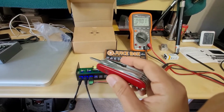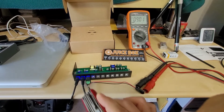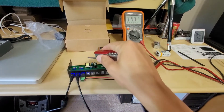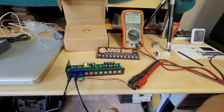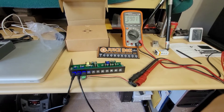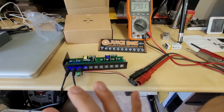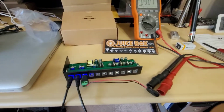As a quick short circuit test to make sure it's protecting itself — we've got 9.01 volts on the second output, and here is the first output. I'm going to short it out briefly, and we should see a quick drop in voltage but it should come right back up to 9.01 volts. That secondary winding should be protected and have enough capacity to keep powering through the short circuit and also the second channel. I'm doing it very quickly because you don't want to stress the components, but it will actually protect itself — all that heat goes into that large resistor underneath. It's doing what it should. It is very tightly regulated with the linear voltage regulators, and I think that's actually really good.